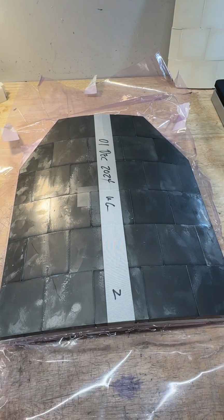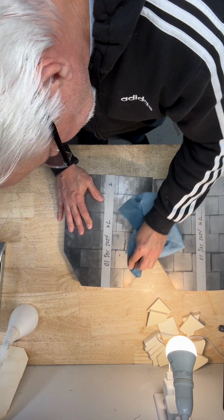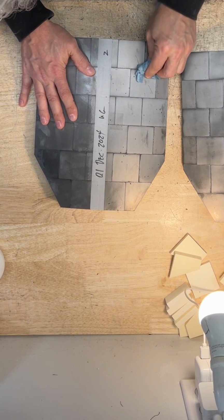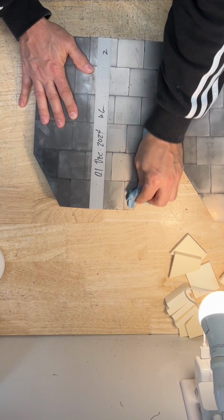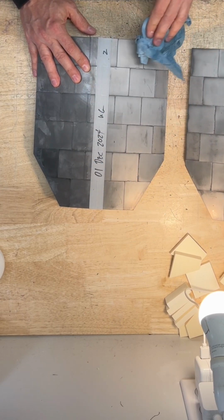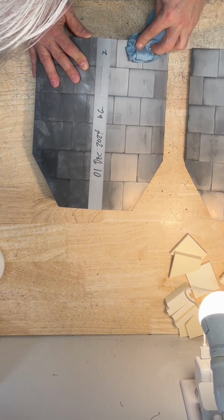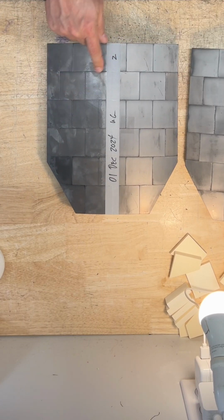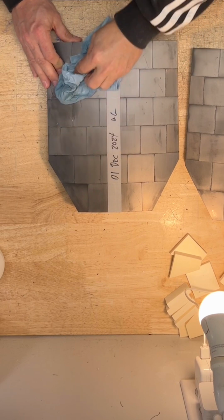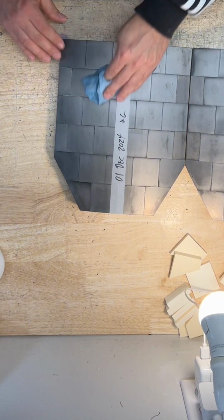And then we'll put a crack arrestor material on here and cover it up. Clean the exterior, clean the strike face off. We want the crack arrestor material to go right on a clean surface, because the production process, the build process, the bonding process, will leave residue on the material. So you'll want to make sure that it's clean. You can see the difference. This has not been cleaned. This has been cleaned. That material on the strike face is grabbing that bare, raw ceramic and not stuff that can pull off.